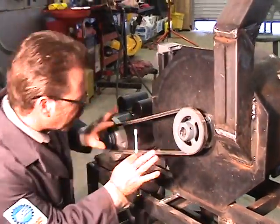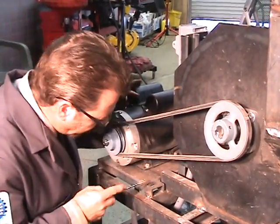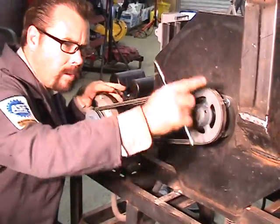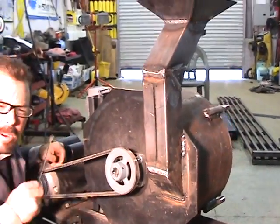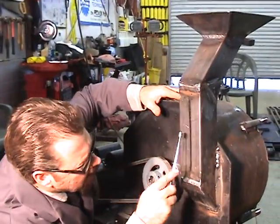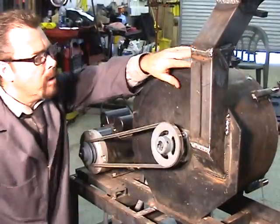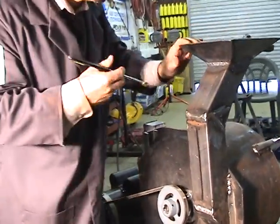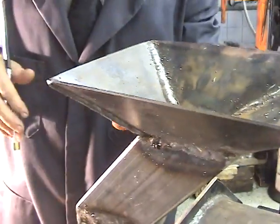The drive mechanism is a three-inch pulley connected to a five-inch pulley with a 22-inch belt. The motor itself is the tensioning mechanism, which sits on four to six bolts and has the ability to slide an inch and a half for tension on the belt. The belt guard will be manufactured at a later date. The feed tube is a three-inch feed tube that comes in through the back. The spin — which I know a lot of you would-be builders are asking — is clockwise from the back, counterclockwise from the front, thus ensuring that the rocks are pulled into the drum and rotated and crushed. If we were to go the other direction, it had the tendency to kick material up the tube. For safety reasons, we put a kink in the tube, and there is a block guard at the very top preventing anything from escaping. The top of the funnel restricts the material coming in down to two and a half inch, so that the feed tube itself cannot be clogged up with any loose material.